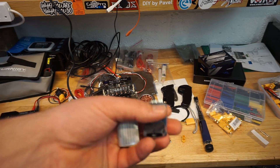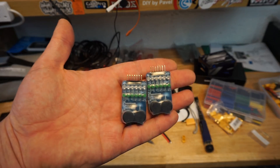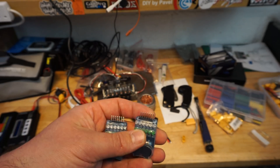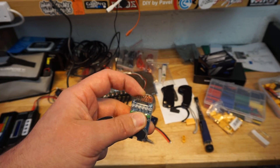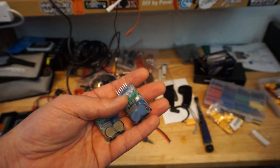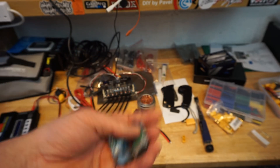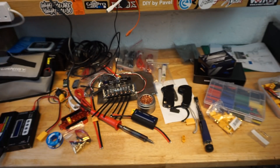Again, these bits here you don't have to have, but these are the low voltage sound alarms. They plug in onto the balance cable on the LiPo batteries when you're riding the board, and they will sound really loudly if your battery goes lower than 3.8V — which is quite nice.